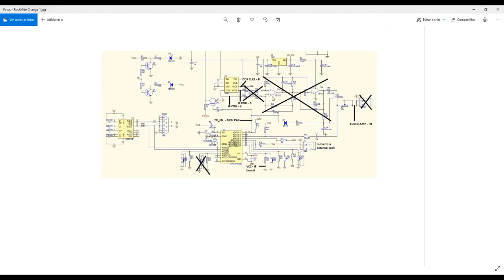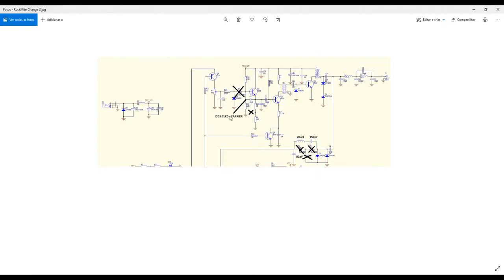The DDS clock one, it's actually here, the carrier node, the frequency responsible for making my first conversion here, okay, my first mixing circuit. So this is normally the one I explained to you before, the desired frequency you want to get the information plus 455 kilohertz, or you can move a little bit to receive a lower sideband for audio purposes, for voice purposes. I explained this in the software part, okay? But this is the first mixing, the first conversion stage, sorry. And this is the input frequency here.